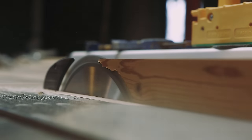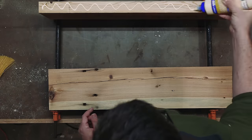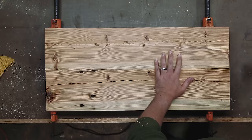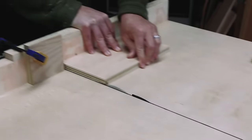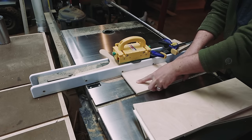I had enough of that same hard pine to make the top, and yeah, I hit more nails. I used the table saw to cut some rabbets in the pieces for the drawer box, then cut a quarter-inch dado to fit the bottom panel.